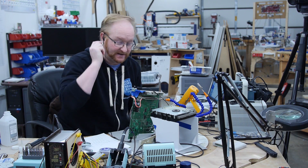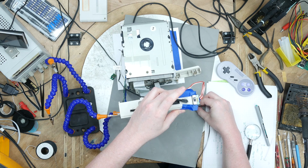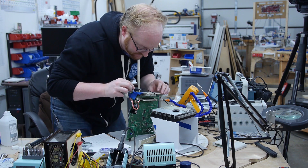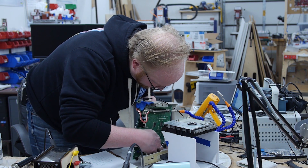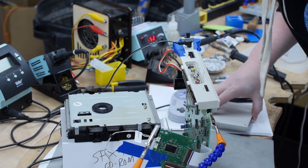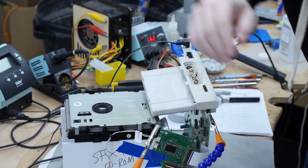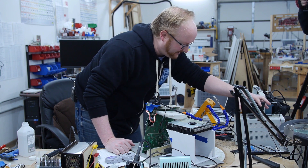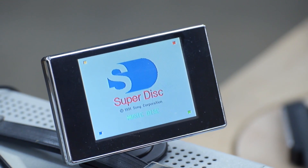Okay, I haven't broken it yet. Now I'm going to try to see if I can get a disc to boot up. We did have some problems before - no CD system. There might still be some jumpers or bodge wires that could prevent that from working. But at least we know the CD-ROM is now working, which means if there is a problem, it's somewhere else in the system. Whoa, we got something different on the screen! No disc... access... music disc. Progress! All right, take it one step at a time.